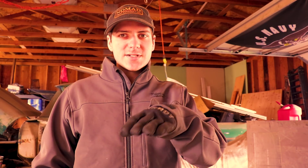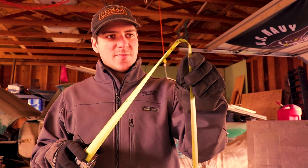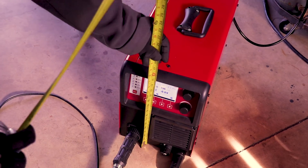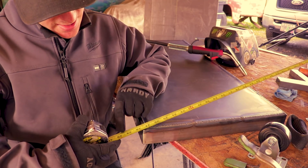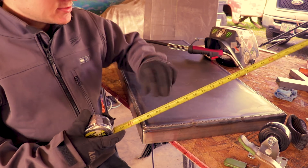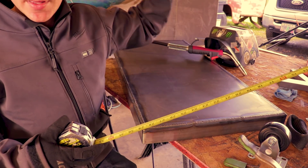It's done. I'm wanting this welder to be at about the right height so that when I'm rolling it around I don't have to get down and crunch any numbers. I'm thinking I want the very top of it to be at 54 inches — so 4.5 feet tall. I'll take 54 minus 14.5, which gives me 39.5, minus 6.5, which gives me 33 inches — that's how tall I need the bottom of that next shelf to be, or the top of that next shelf.